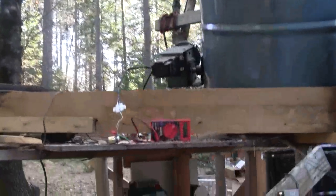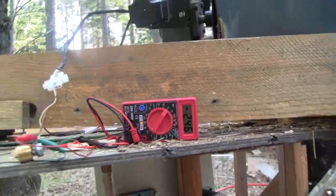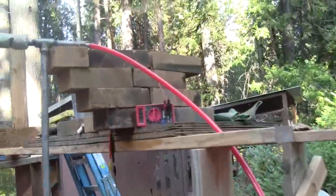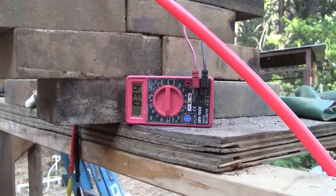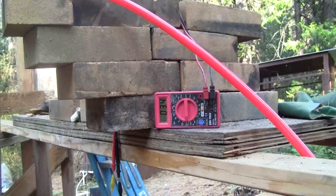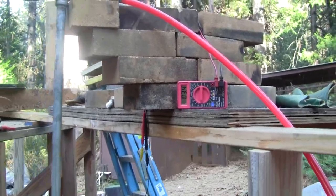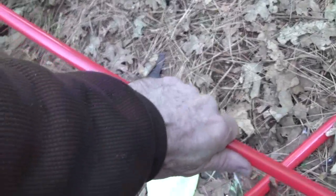I use this little potentiometer and that multimeter to set the speed, which basically sets the flame power. This has been running for about an hour and a half and the house is already warm. The water temperature coming out reads 3.4 on the thermocouple, which is about 68 degrees Celsius — so roughly 70 Celsius, about 150 Fahrenheit. It's coming out of this tube for now, and it's not insulated yet.